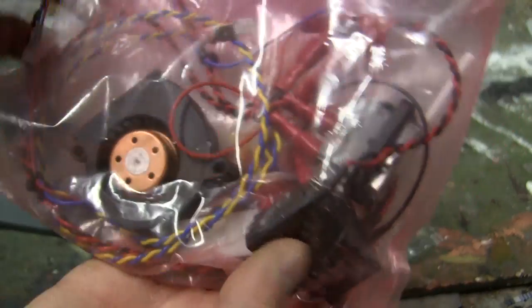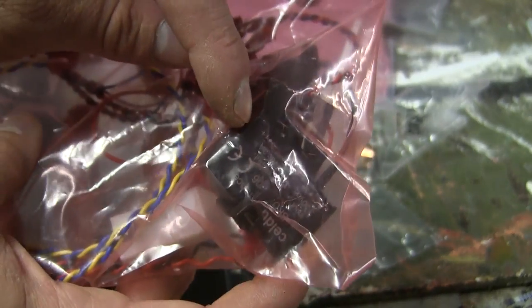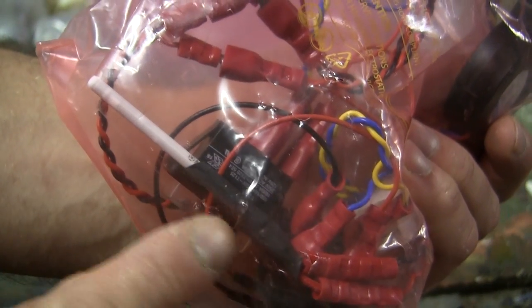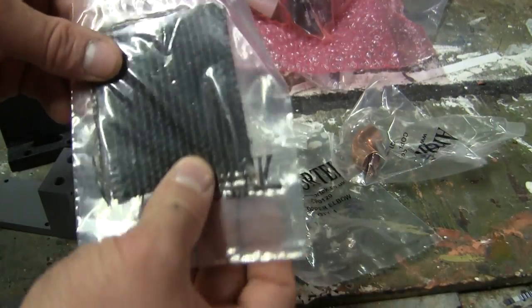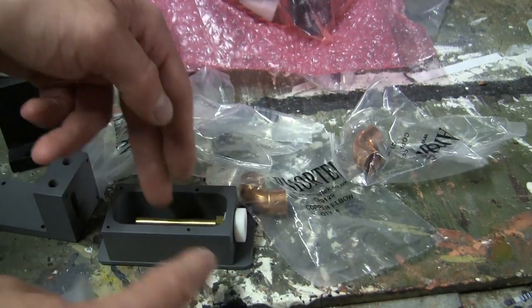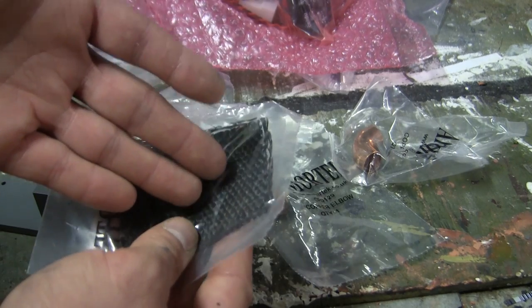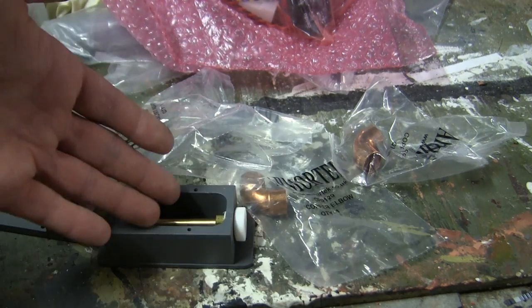The electronic components include the blower fan, a main power kill switch, a small transformer, as well as the most important component — the heating element. It's all come pre-wired and can be assembled out of box. Also included is a fiber mat. The mat is your actual wick, which once installed into the reservoir and impregnated with the smoke fluid agent, is what actually smokes. The heating element starts cooking the mat, which doesn't burn but gets hot enough for the smoke fluid to start evaporating, which gives you your smoke.